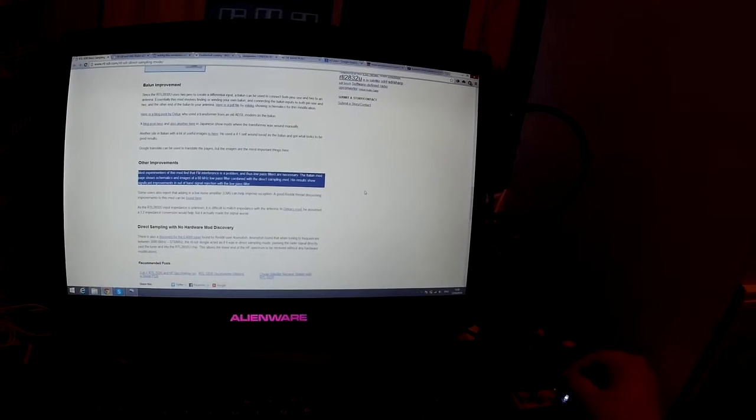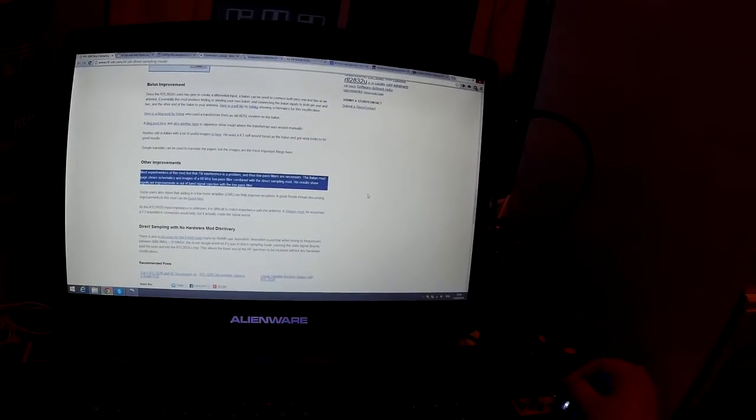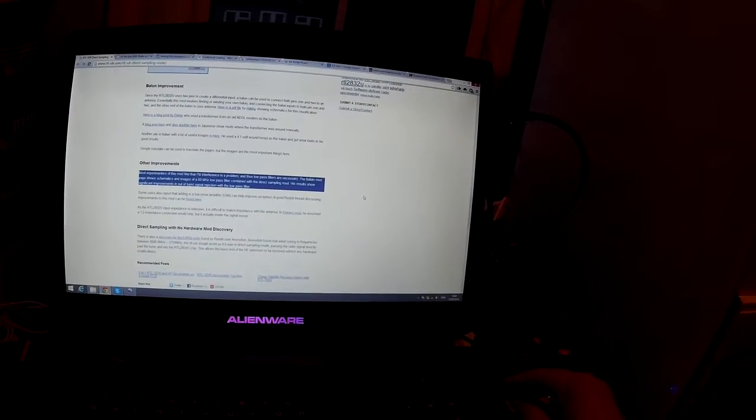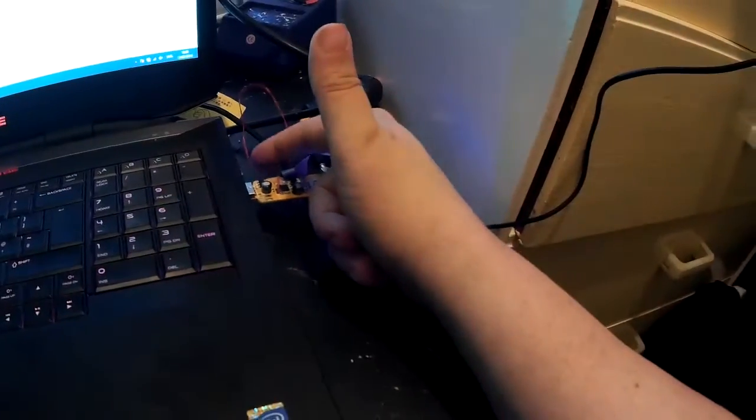But also, all I'm going to try and do is disconnect pin 1 from the centre pin of the antenna connector, which you saw me solder on. I'm going to get rid of that just to see if that improves anything. And then connect the antenna directly to that mod wire, the red wire, and connect that up itself instead of through this connector. You know, which is kind of what I should have done anyway. But then I was curious too. I wanted to see what happened if I come in here.